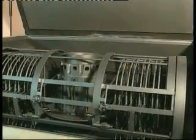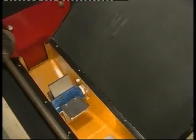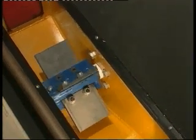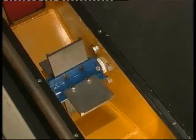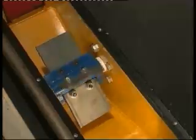The cabinet is constructed of reinforced high-grade steel and rubber lined to reduce noise and wear. The base of the cabinet has a manganese steel lined trough, which houses the twin chromed steel paddles to propel the blast media. The impellers are protected by triple sealed bearings, which give years of service with minimal maintenance. The routine removal of dust from the extraction unit and maintenance are covered after this brief presentation film.